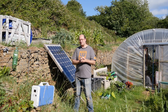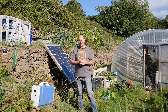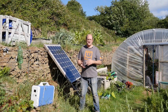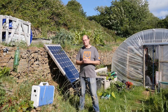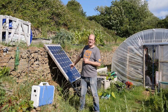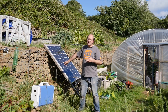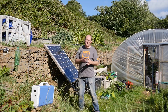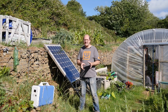If you're not entirely sure about the voltages, don't worry — Max Oak also sell their own custom branded solar panel which you know is going to work. We're going to review that next month, so stay tuned. In terms of charge time via solar, this depends entirely on your location and how much sun you get. With three 120-watt panels — about 360 watts total — it would take around six and a half hours of peak sunshine, which should be doable in a day.